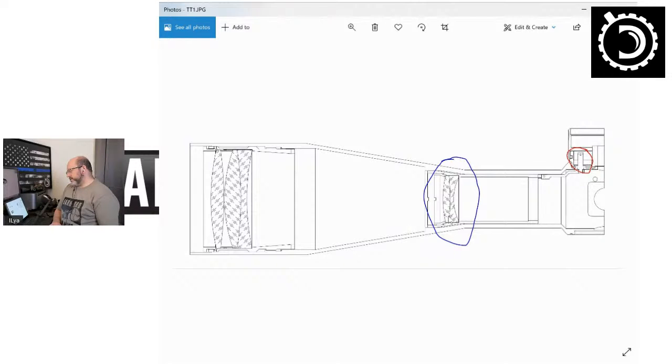There are some advantages and disadvantages to this, but this is one of the reasons tangent theta has certain optical advantages. They have a rather sophisticated focus group, and it's fairly far forward. The way it is linked to the parallax turret, right? There is a metal aluminum tube that's inside the main tube. This is the focus cell. The lenses that are moving are at the very front of this parallax cell, right?